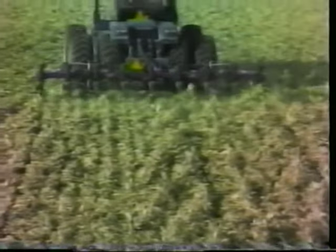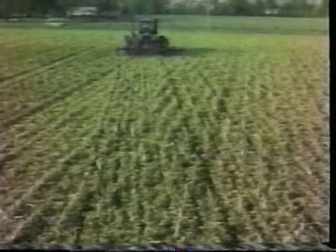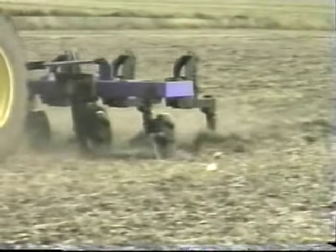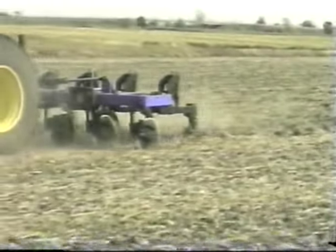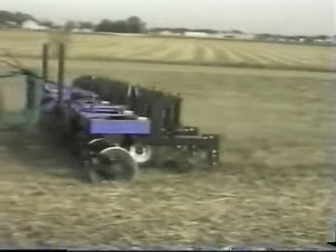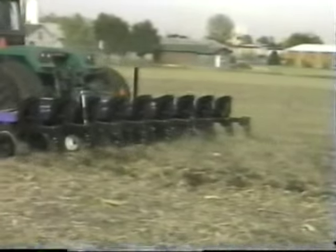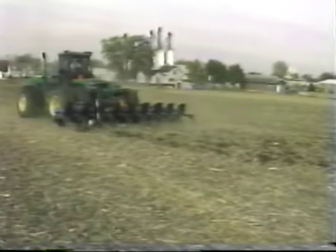The no-till shank, available only from DMI, is only 3/4 inches wide for minimum surface disturbance. The unique no-till point, with specially designed 8-inch wings, opens compaction in the root zone to increase air and water absorption and percolation, while leaving the highest possible percentage of residue covering the surface.